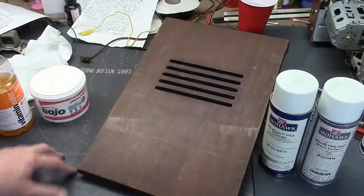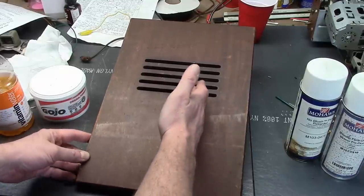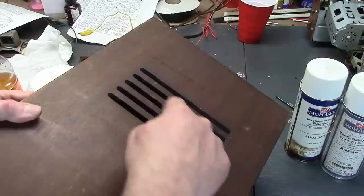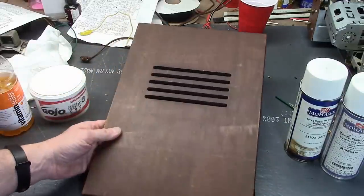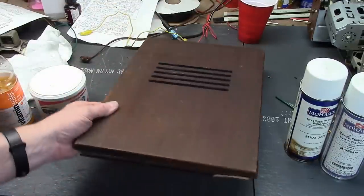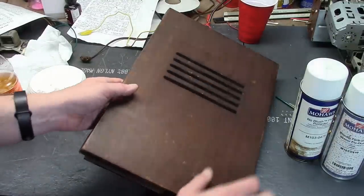Let's start with cleaning and see what we have to work with. It's a mahogany veneer — looks like there are two pieces with a seam. It's a very basic box cabinet, not a whole lot of style to it, which is why I'm inclined to experiment. What I might do is forget about lacquer toner and just use some water-based acrylic with burnt sienna or a dark brown and brush it on inside there — I've done that with some Philco radios for the speaker grill. You can't spray in there realistically without getting it all over the place; brushing is far more effective.